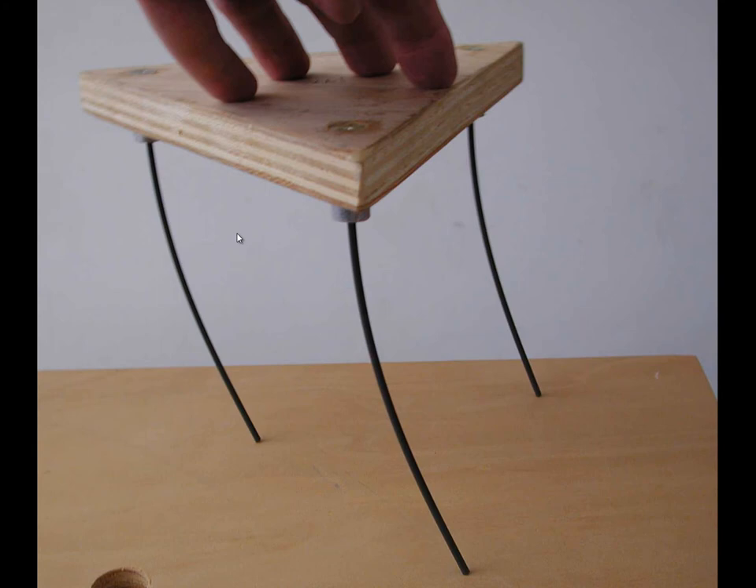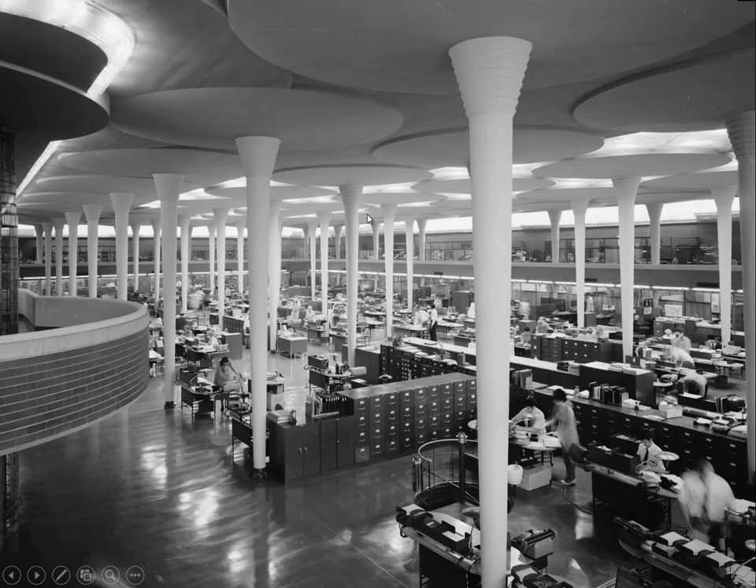Finally, we can have a table leg model of stability where the moment connection is only at the top and not at the base. You'll notice we're getting tilt at the base, which tells us this is acting as a pin joint, but it's coming up vertical at the top, which tells us we have a moment connection up there. This is the Johnson Wax building designed by Frank Lloyd Wright. It has a spindly thin column down at the base, which gets fat up near the top, and there's actually a moment connection to a structure up above.